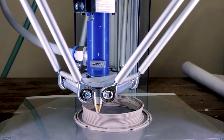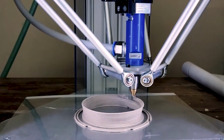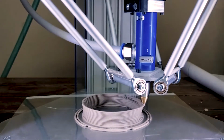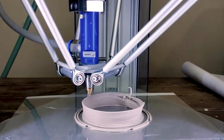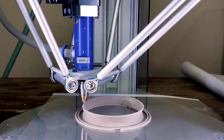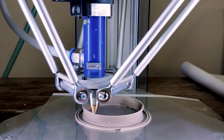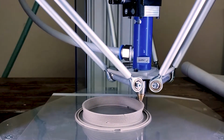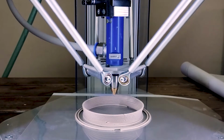And the printer, if it goes over an area that's not flat, as you can see, it just bubbles up. You can see the printer doesn't print properly at all. So yeah, that was a fail. The second one I did still wasn't working. I slowed down the speed quite a lot, but I kept all of the other settings the same. And I shouldn't have, because there in the back, it's still falling in on itself. So it's all about speed.